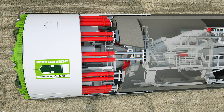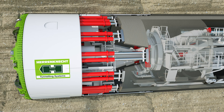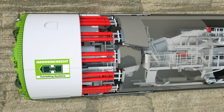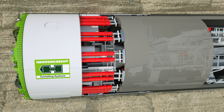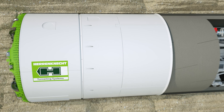The erector is mounted on two rails and can be moved longitudinally, rotated, and telescoped. The erector lifts the stone from the segment feeder. The hydraulic cylinders are then retracted from the corresponding installation position. The segment is positioned precisely against the previous ring. During this process, machine and tunneling personnel are protected by the shield against the earth pressure and possible groundwater. The rear part of the shield, the so-called tailskin, is equipped with a circular tailskin sealing between the steel structure of the shield and the segment ring, ensuring the necessary sealing between the interior working space and the exterior earth and water pressure.